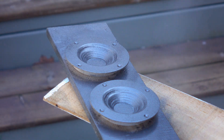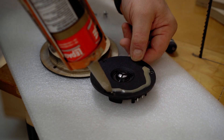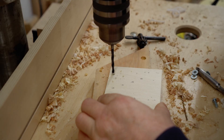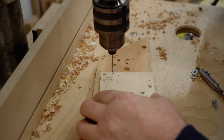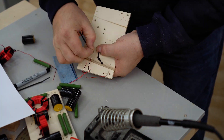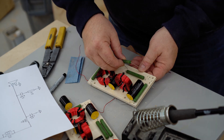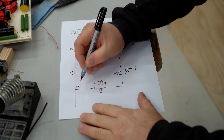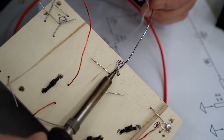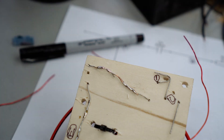I took the measurements and used a free program called XSim to design the crossover. I'd never used this program before, but I was really impressed with how accurately it nailed the crossover — comparing the simulation to the final measured results from the speaker, it's a perfect match. It's incredible how well this software works, and it's free — there's a link in the description. For the measurements themselves, I used a program called REW, or Room EQ Wizard, and the measurement microphone I used is a miniDSP UMIK-1, which is a calibrated microphone that really doesn't cost a lot of money.